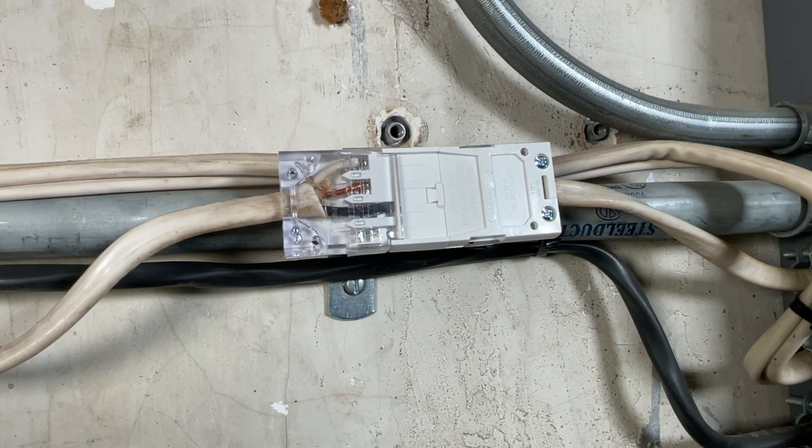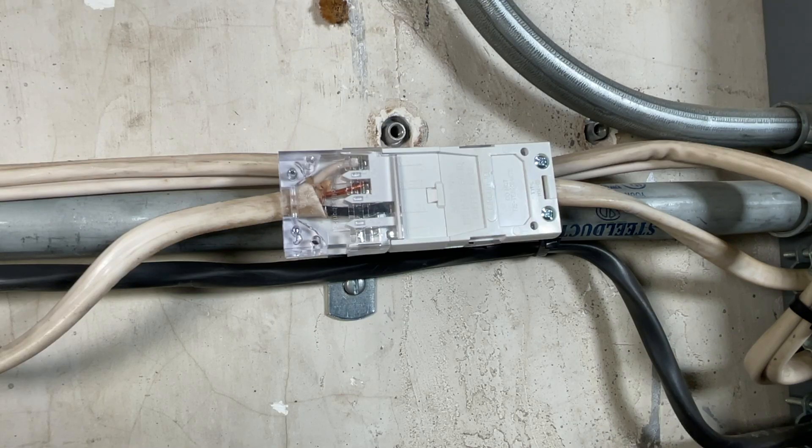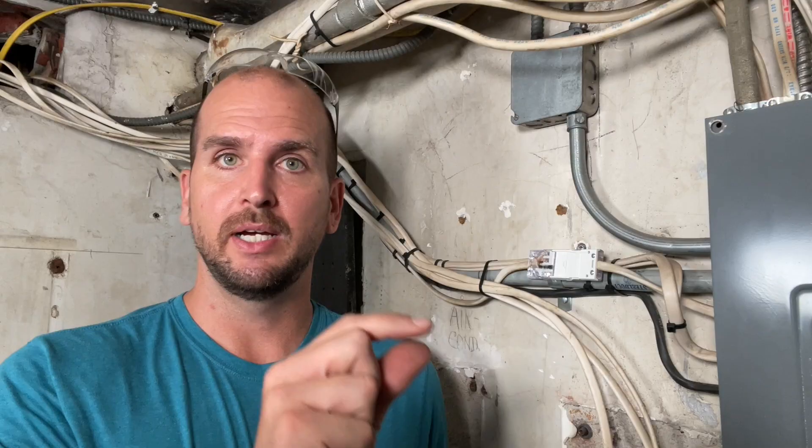If you want to go the extra mile, some people would prefer to wrap this with electrical tape just to be confident it'll stay together and have another layer of protection — but that is up to you. This is approved just as it stands without the electrical tape. Now, I kept saying this is approved and meets NEC, which it does, but don't forget that your local municipality might have additional codes on top of NEC. And if this came up on a home inspection as a safety issue, proactively check with the inspector and ask: if we fix this with a TE splice kit, would that satisfy the safety issue and take it off the inspection report? Most likely they're going to be in favor of that. But at least you'll have that conversation before you do it yourself or pay a professional.